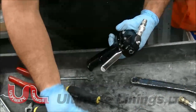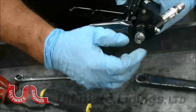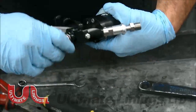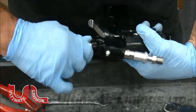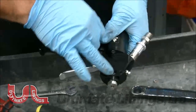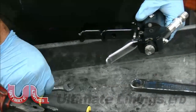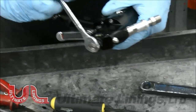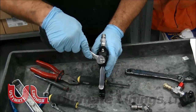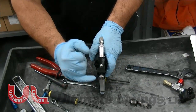Now you're ready for your spray tip — it just slides right in, doesn't have to be in any position. Then your spray cap. Make sure it's greased up and everything inside is clean. Be aware it is possible to cross-thread the mixing chamber — so be careful. As you're torquing this down, this is the natural point of stopping — no more than that. You'll have the spray tip sticking out just a little bit.